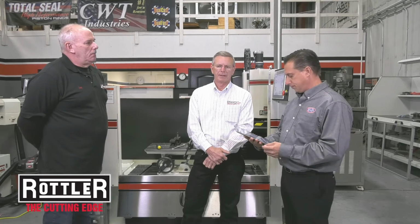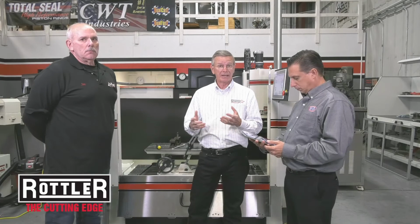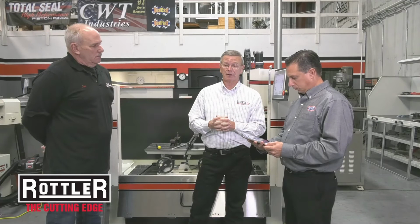All right, next question from Alex. Alex, thank you very much for your question. What about machining for a top hat liner? Does it auto tool change, is the question. I'm not sure what Alex means by that question. Yeah, what about machining for a top hat liner? Does it auto tool change? And we have more as well, if that's an earlier question that got into our feed. So the machine will not automatic tool change. It's a surfacer only, and depending on the material you're using, that brings up a point. I think Hal and Chris alluded to CBN and PCD, and they're correct. PCD is an aluminum only insert. CBN can be used on either. But as Chuck Lynch, I think, iterated in his subject, the CBN, although you can use it on aluminum, probably isn't the optimal for surface finish.